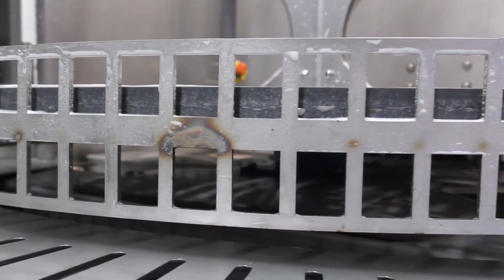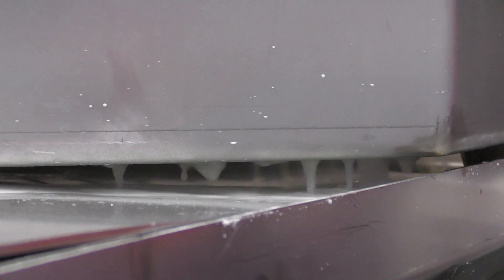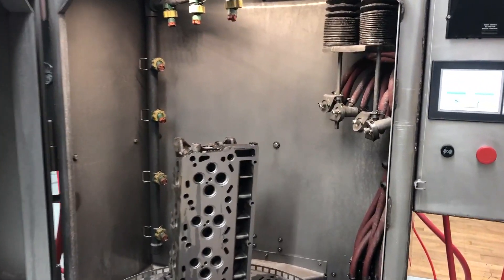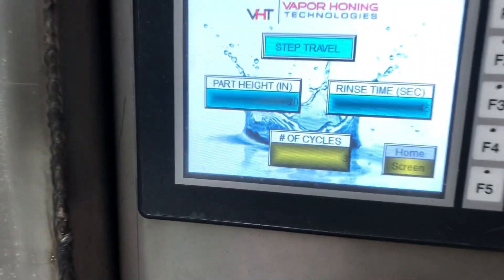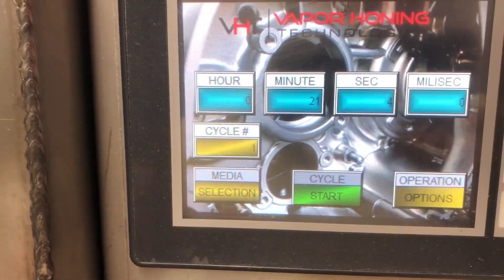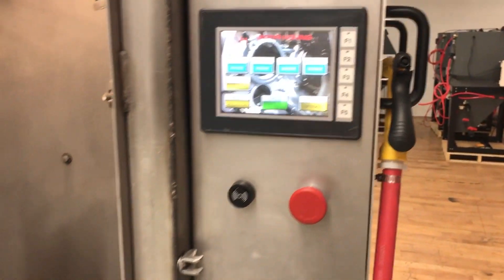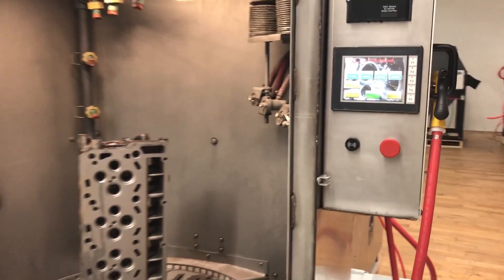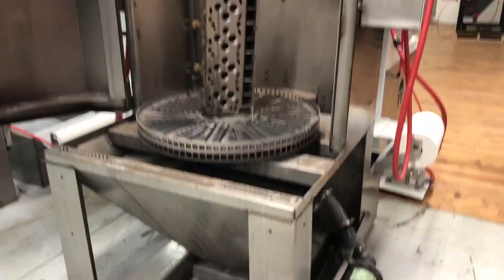It's 145-degree liquid — we have parts washing detergent in here and the abrasive loaded in. We actually have a combination mixed in the cabinet. But the most amazing thing we pride ourselves on with this machine is the easy setup on the HMI. It's super easy — you can't even mess it up. If you don't have a parameter in, the machine's not going to work, it's not going to run.